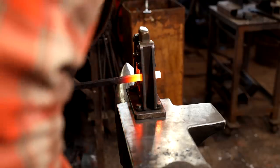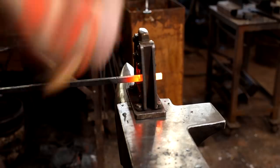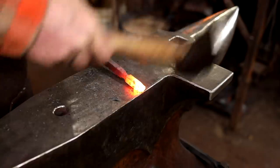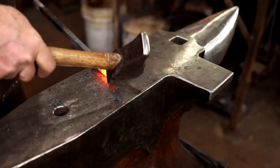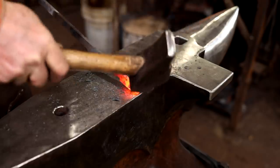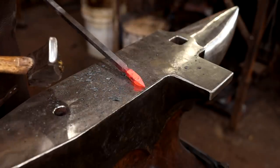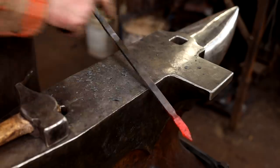I'm going to use the guillotine tool to isolate a mass at the very end of this — it will be a very simple poker ring, since the twist is really the point of the video. Notice how I'm working so the hammer is off the edge of the anvil; if I work back here, I'm going to be striking the anvil with every blow. That's all I'm going to do for that point. Now I'm just going to blend this in so this thickness transitions to that thickness.